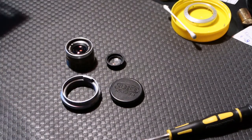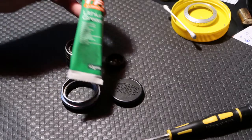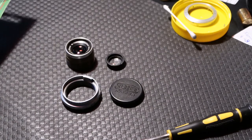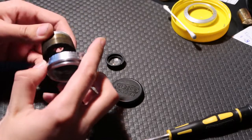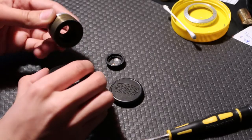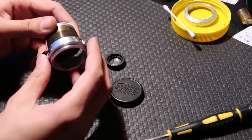For the grease I used a standard lithium grease. It just needs to be smooth enough not to gum it up. It also depends on whether you want stiffer or smoother focusing. You just put a few little blobs around — just enough to make sure it's lubricated. You don't want too much, because then it'll be too stiff, and that was the problem we were trying to fix.